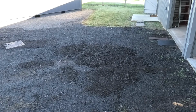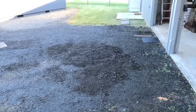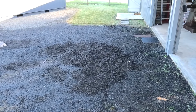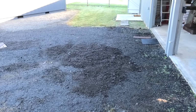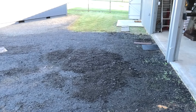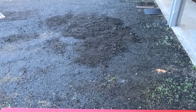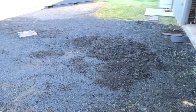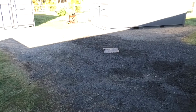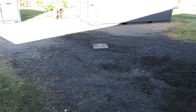That's a little better. Here we have our big dilemma, and surprisingly it wasn't the drive wheels, it was the steer wheels of the forklift. When they pull a sharp angle, I suppose the smaller diameter makes them get stuck into the road base, and that's pretty heavy. There's about 75 mils of road base being put down over the years and tramped down, but right up to the entrance to the second container has been made rather unusable.